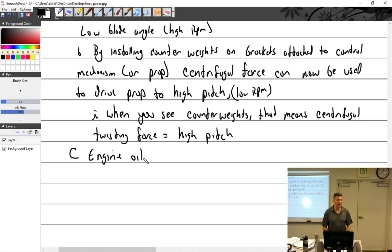Yes, I don't have a twin rating, but that's my understanding. That is one of the biggest problems, identifying the right engine. One of the Barons I worked on actually had an indicator. It had pitot tubes under each engine. They were thrust indicators. So if you lost thrust, the prop wouldn't be thrusting and it would give you an indicator: it's that engine.